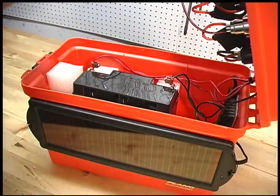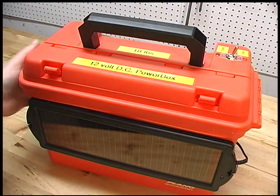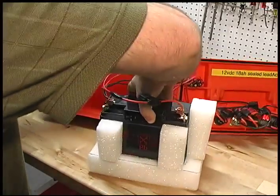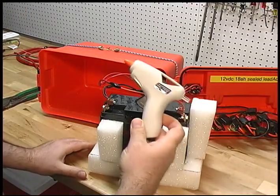You'll also need some wire connectors and a 12-volt sealed gel cell battery along with a rubber grommet. I personally chose the largest battery I could find that fits in the tackle box comfortably with the lid closed — it happens to be an 18 amp hour. Do not use a car battery, lawn mower, or motorcycle battery for this project. A car battery contains sulfuric acid which could leak out, and car batteries hate being jarred, bumped, and dropped. You'll also need scraps of styrofoam sheeting to nestle the battery and hold everything in place.